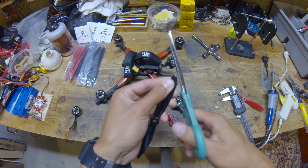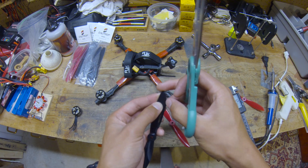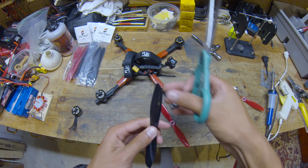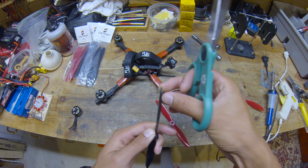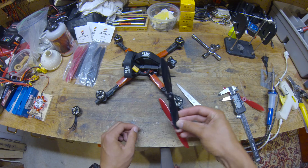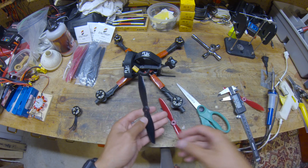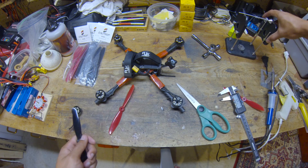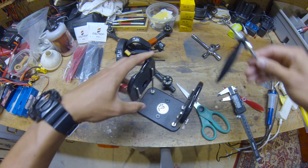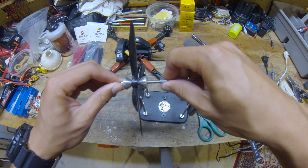If it helps, you can do a series of linear cuts to get an overall rounded shape — it doesn't really have to be perfect. These props get dinged up anyway, so don't worry about it being completely perfect. Now we have a much more rounded prop. The last thing we're going to do is check the balance, since we did remove material. I'll put a link in the video description for how to balance props, because that is a good skill to have.